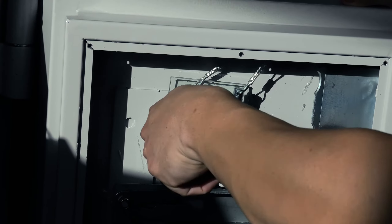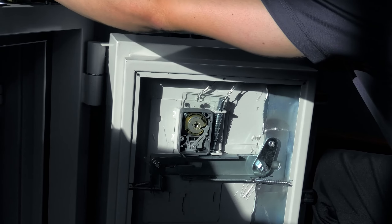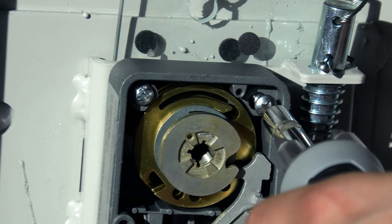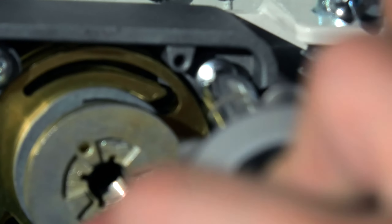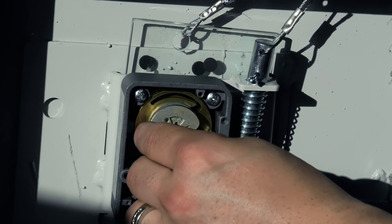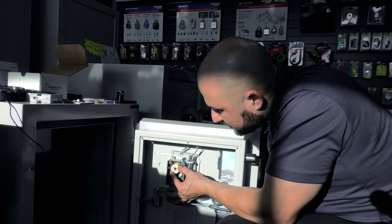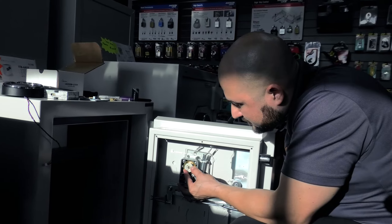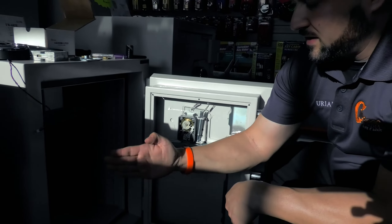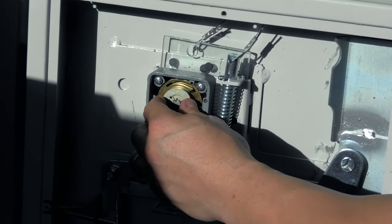There we go — the lock pack is seated properly between the re-locker plate now. I'll lock it on with one screw, then put the other top screw in. The longer screws go on top because they have risers that recess a little farther, and the shorter screws go on the bottom. Now I need to make sure the spindle screws through and works — I don't want it coming through at an angle causing any bind when I turn it.